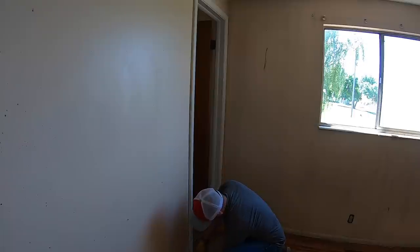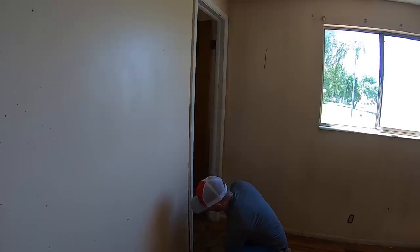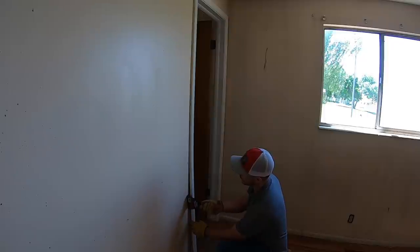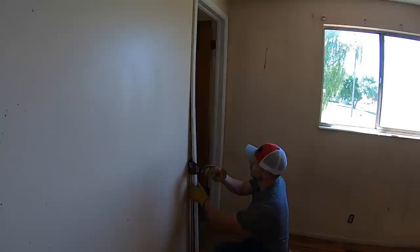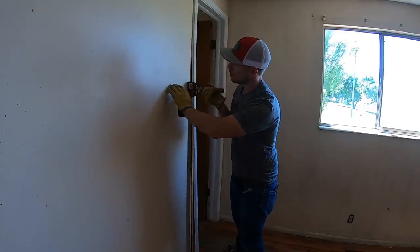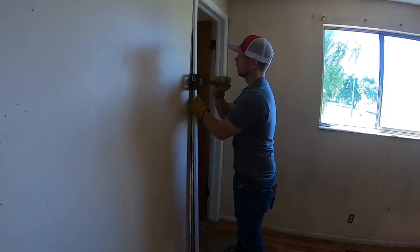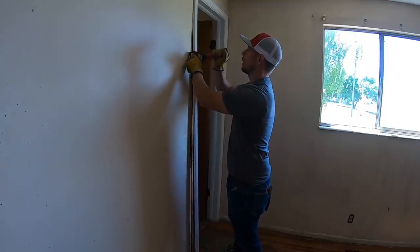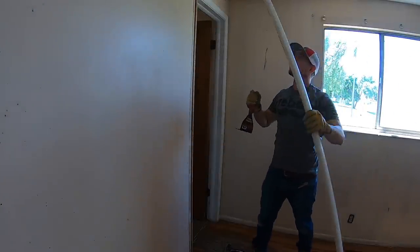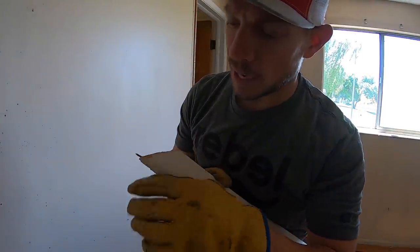With your door trim it's the same principle. Just get a section, start it, and work your way up. I like to get it back behind and tip up just a little bit. Whatever you do, you don't ever want to pry it this way — there's a chance you're going to pinch that sheetrock or break it. You want to just pry it up, parallel to the grain. There may be some minor damage if you're putting it back, but nothing a little sanding and paint won't fix.